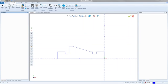So if it starts blinking real fast, that's because it's trying to process each individual surface as it brings it in. So you have that one, that's one thing. If you have that and it takes a while for the simulation to load, especially when you are doing a broken solid, as it loads the sim, it's trying to bring that all in, process everything. It takes a second. If you turn off the solid model before you launch the simulation, so you just turn off the layer with the solid model, then launch, it'll launch a whole lot faster.